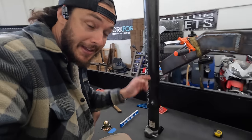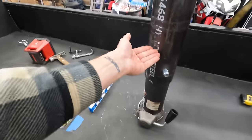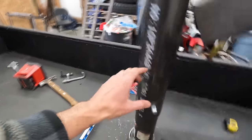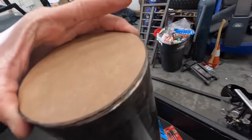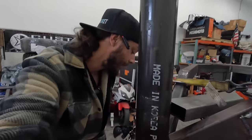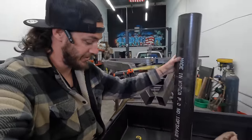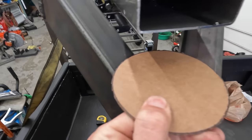Back at the shop with everything drilled. Now we need to attach the coupler assembly to the trailer. I've set the coupler one step above the lowest position — that way if we ever hook to a bigger vehicle we still have adjustment. I cut a piece of cardboard to the exact radius of the trailer frame neck. The idea is to hold it level against the tube to give us the correct radius for our cuts. We've really only got one shot at this. Zach's here too.